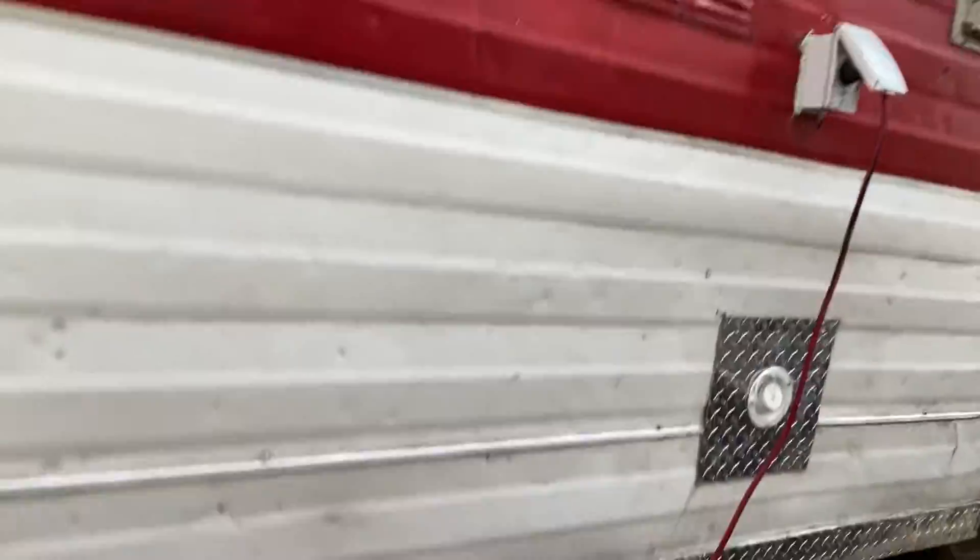So that concludes the session today. As you can tell, we pushed air using the air compressor through the water line. We went inside and it turns out it expels water better when you do one utility at a time. So first, close all the lines and just open one of them — let all the pressure go through that one. For example, I closed the shower and sink knobs and all the water went through the water heater. Then close the water heater, let the water go through the sink. Close the sink, let the water go through the shower. In this case the shower didn't have any water because I recently replaced those lines, so they were already empty. It seems like it worked like a charm — a lot of water came out of the sink.